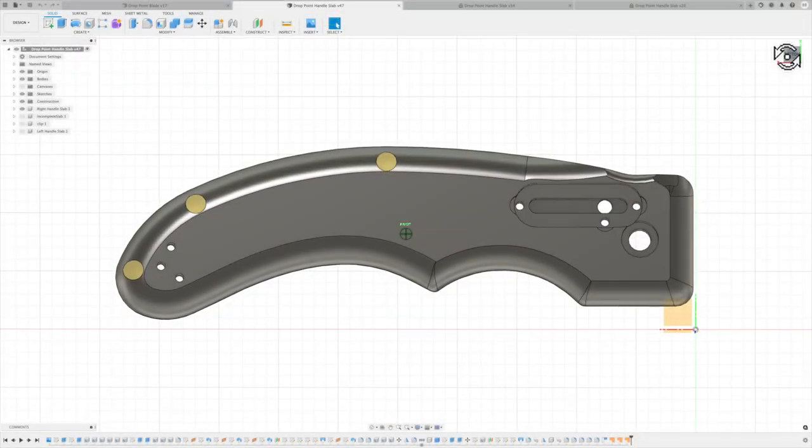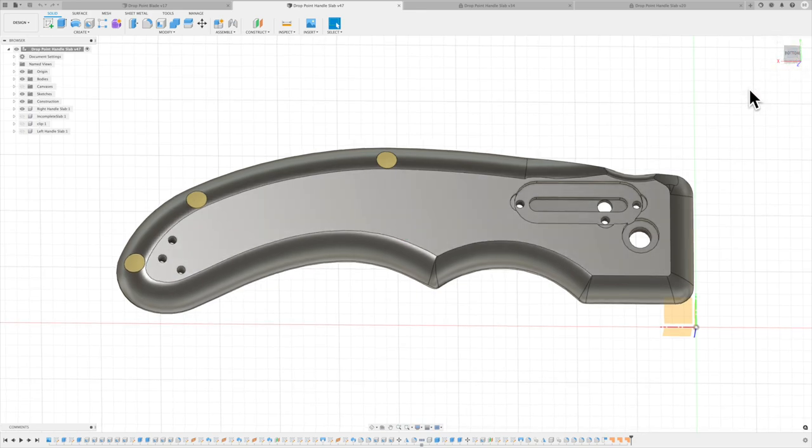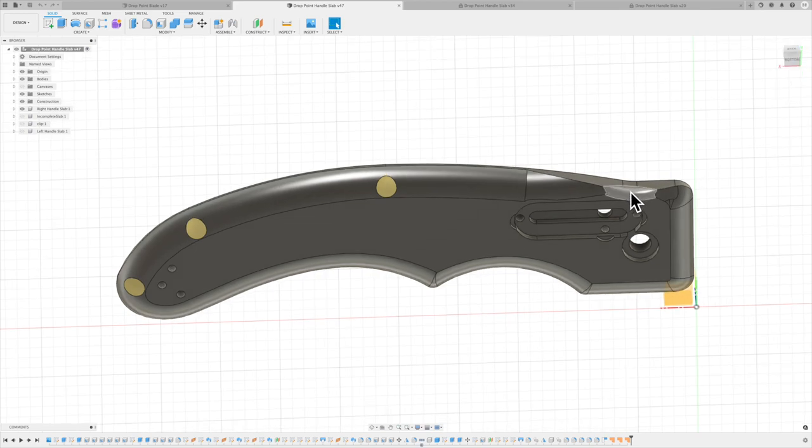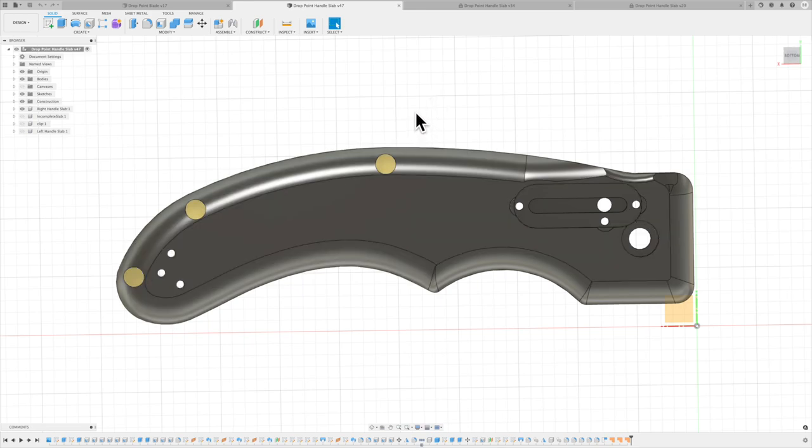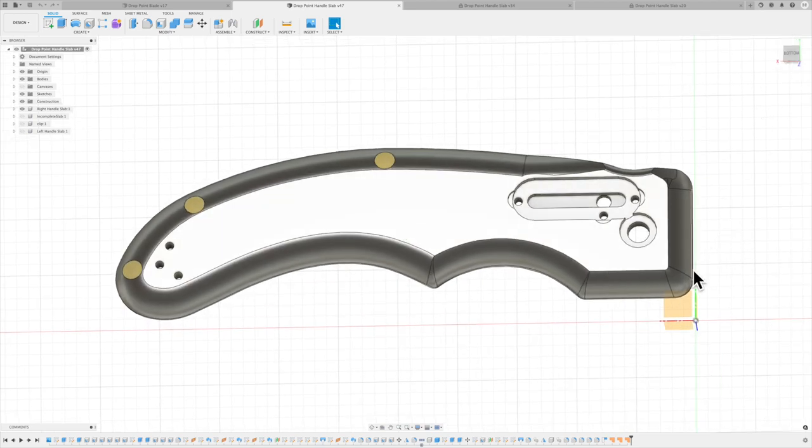After pulling that first test piece off, I could see visually I needed more radius on these two corners, could bevel the edges a bit more, and clean up the sweep around this corner. The main fix was cleaning up the tool path — thanks to the Titans of CNC forum on Facebook. By adding patches to cover up the holes, the contour tool path got cleaned up dramatically. You just go into Surface and add a patch to your model, which lets it machine over the top instead of jumping around the holes.